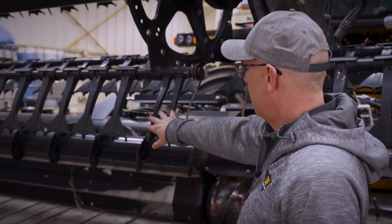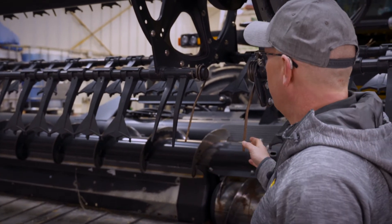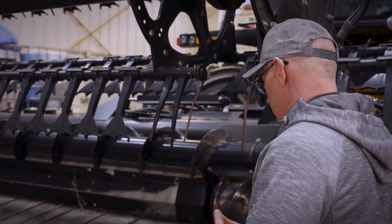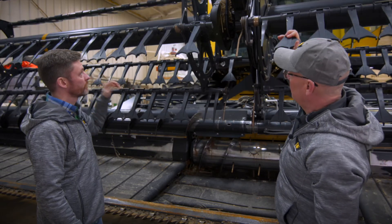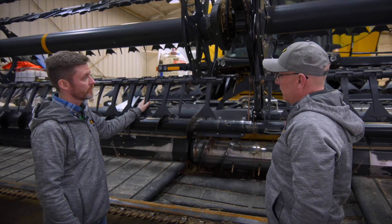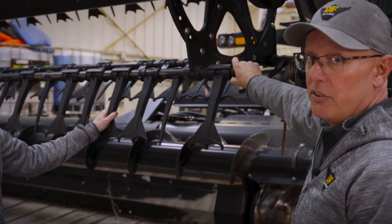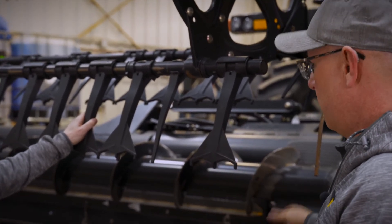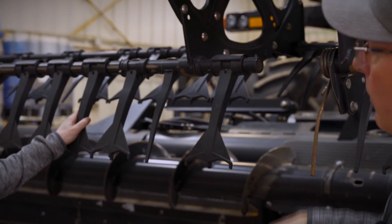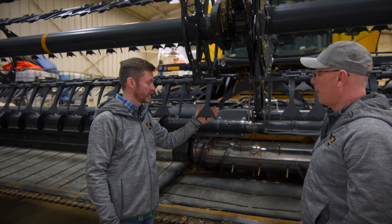In the middle here, on the factory setup, this is the way they set it up with the steel finger. What I've found really beneficial — because it's a double knife drive — is right there, and so it's a problem spot. What we do is take and remove the outside plastic finger and the steel finger outside, then put your duck foot on. It gives you a nice wide paddle to keep everything moving. I recommend putting them on every single one on that double reel configuration — it's really going to enhance that precision header as you're harvesting.